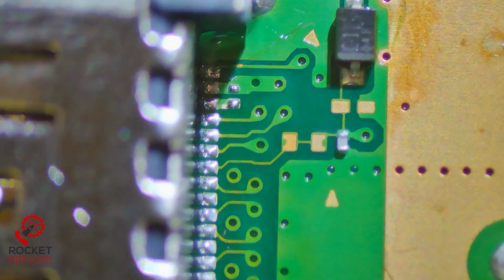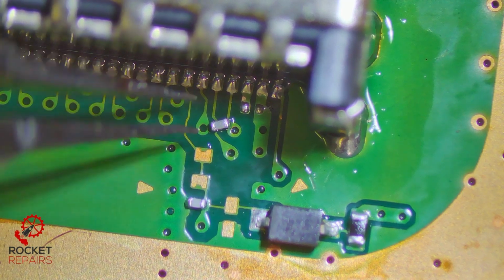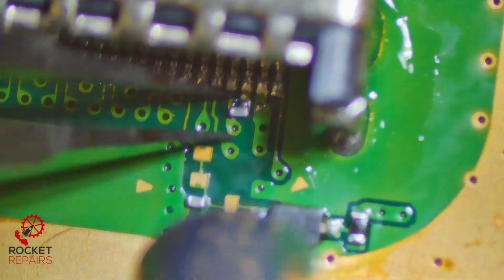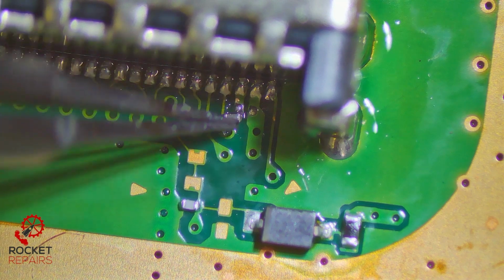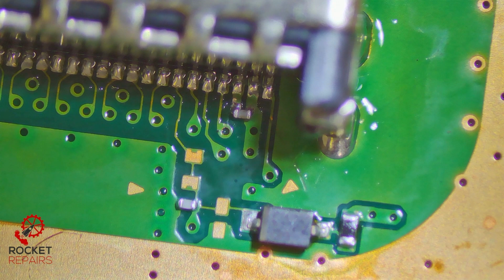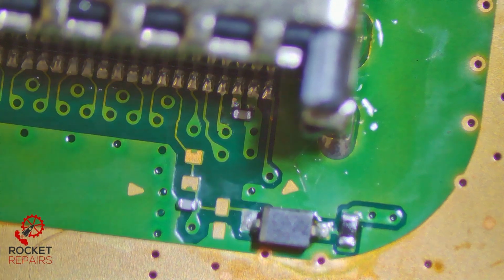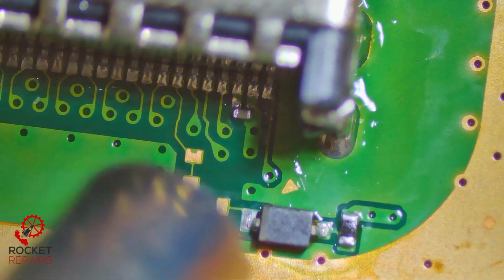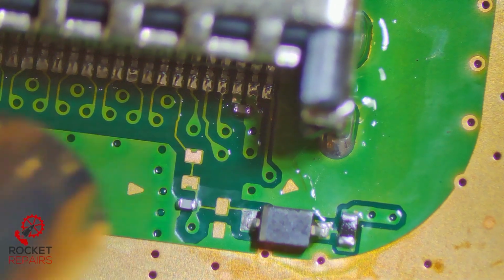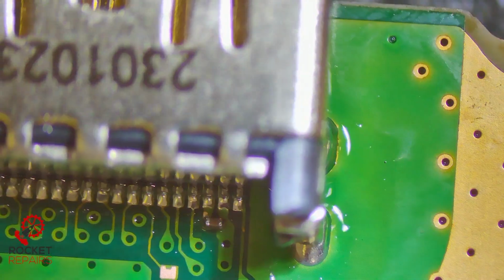And now this is the little cap that we have to replace. Here we are, there's that little cap. Just put it on there, drop some flux. I'm just going to go back and forth real quick. There we go, pop. See that? Enough so that we don't singe the plastic, as you can see.